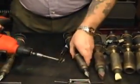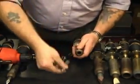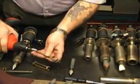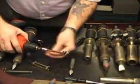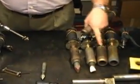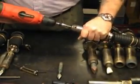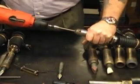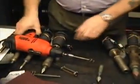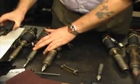Okay. We're going to go ahead and step this down one more size. Again, this is just showing you how quickly we can go from one size to the other. We have 5 large size irons in our basic array. We go from a 1 1/8 inch diameter 3198 iron down to the 3178 iron, 7/8 of an inch, the 3158. The next size down is our 3138 iron, and that's this size here. Then we have our small irons, our 3125 and 14, which are both 1/4 inch tips.